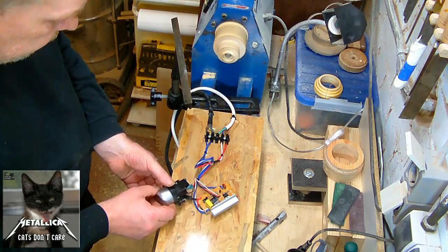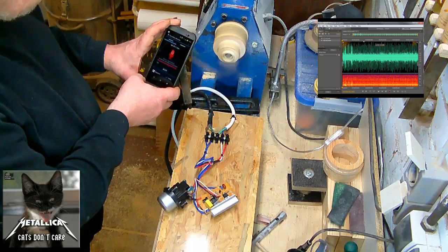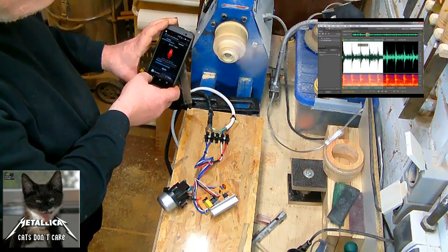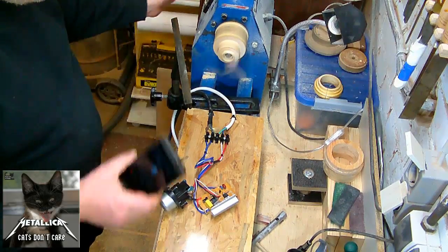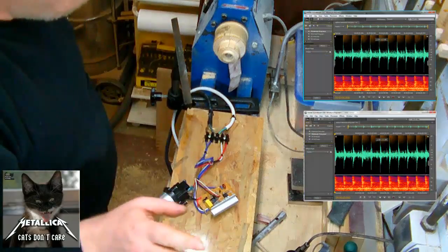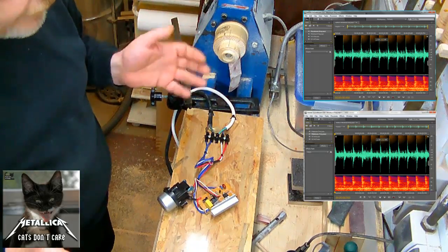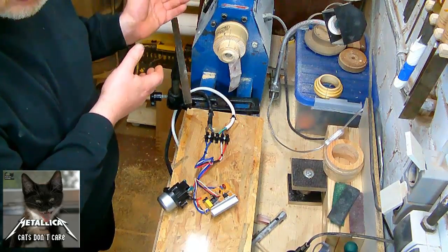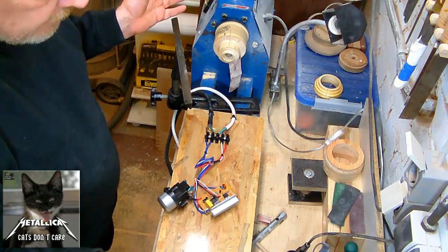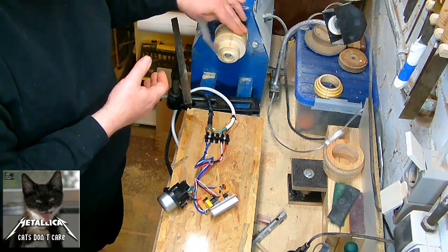You can hear it: step, step. And we record a second time. The results I've got — when I put them one over the other, you can see there is actually no difference. This means the flaps have the same amount of time in between, which gives me the idea there isn't a change in the frequency — so the rounds per minute this thing is doing.